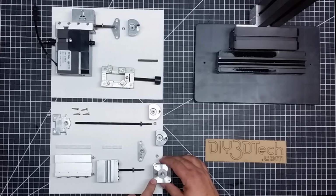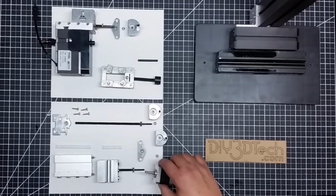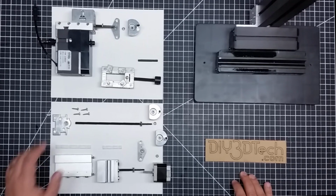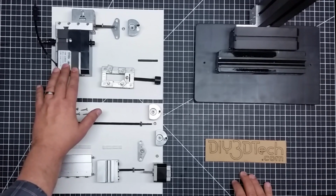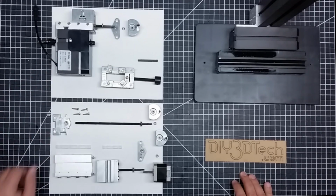So I think I'm just going to take a standard NEMA plate and then build it up in CAD to receive it. Now, it's not going to be taking a lot of torque, so I think 2 strong stanchions should be enough to hold it. I'm not going to be doing anything too crazy because the motor is only a 36 watt motor, so it's 12 volt 3 amp.